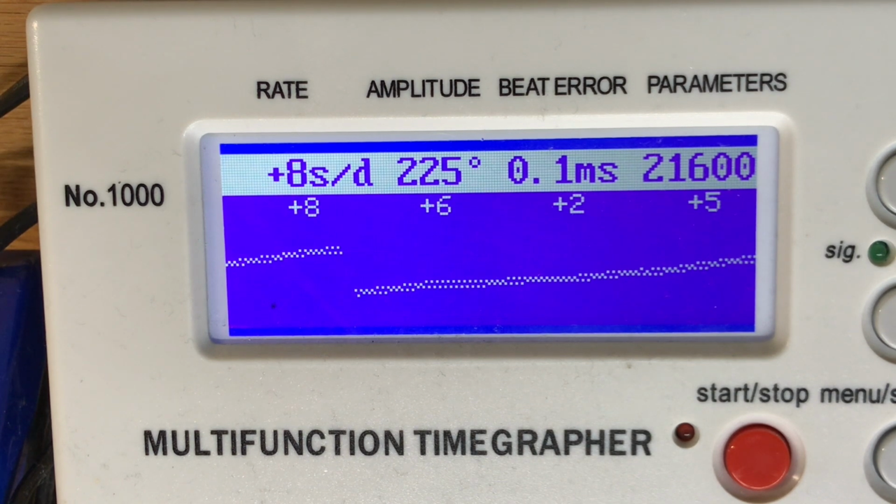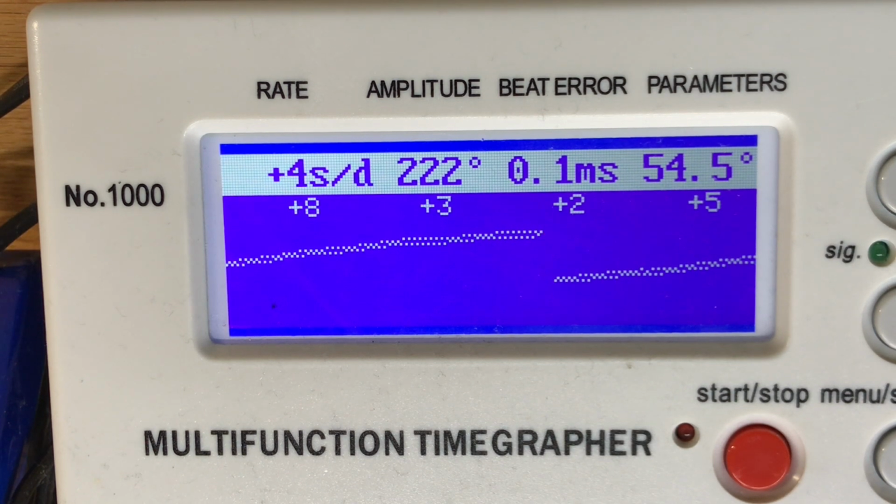In particular, it takes a little extra effort to get them over 230 to 240. They're not a heavily jeweled movement. They were never considered to be a performance, chronometer style movement. They're sort of the lowest end of the Seiko line in that respect. They have more bushings in the main plate than they do jewels.